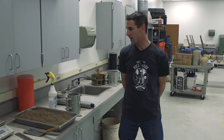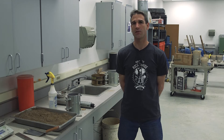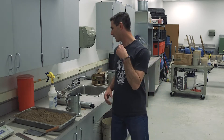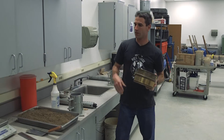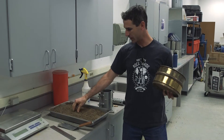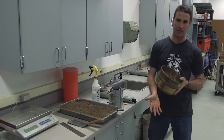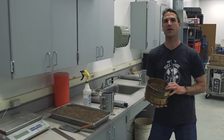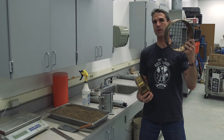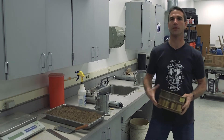For T-99 and T-180, when you come in to certify, a lot of the sample prep will already be completed for you, but you will need to talk us through sample preparation from a raw soil sample. You will start with a soil sample that has already been prepared. You may need to add some moisture to get it four to eight percent below optimum. Depending on the method — T-99 A, B, C, or D, or T-180 A, B, C, or D — you will pass the sample through either a three-quarter inch sieve or a number four sieve after drying it until it is friable. Our material has already been passed through a number four sieve.